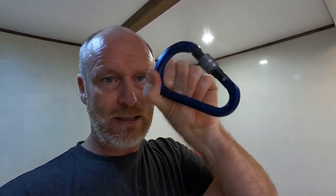I went through the solo mast climbing gear and found a couple of these carabiners worth having a look at. These aluminum carabiners — I did a lot of climbing and outward bound stuff in the past — they can't stand any kind of damage whatsoever. On this one there's some corrosion to the point where there's actually a sharp edge on it, and clearly if there's any kind of micro fracture in there and this gets used for life-saving gear, this is incredibly dangerous. So this one is getting thrown away.